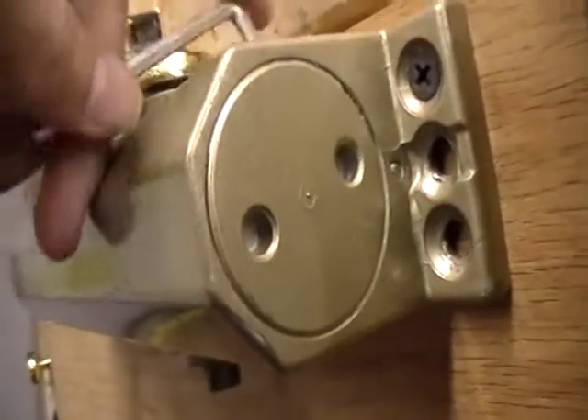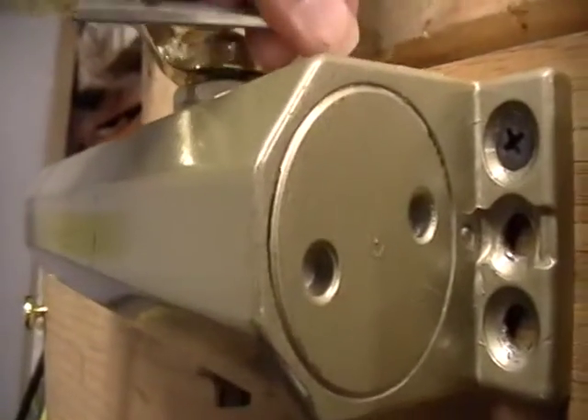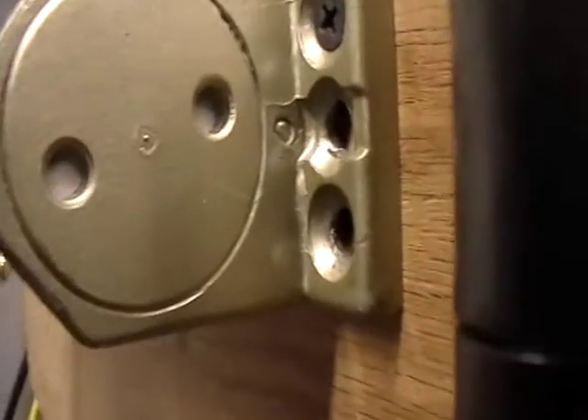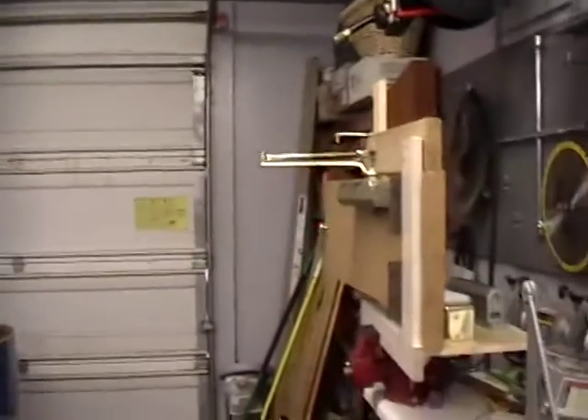All right, we're gonna speed up the sweep a lot, and the latch like an overdramatic amount of speed up. It's gonna go really fast. See? Told you it was. Watch how fast it'll go. See that? Now if you had some kind of place where you needed the door to close as fast as you possibly could, this would be the perfect speed right here.